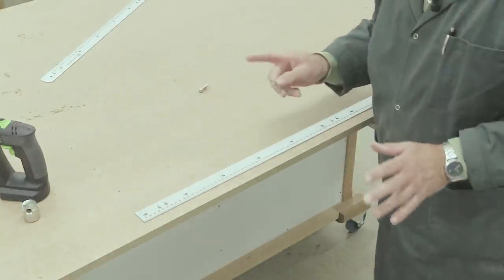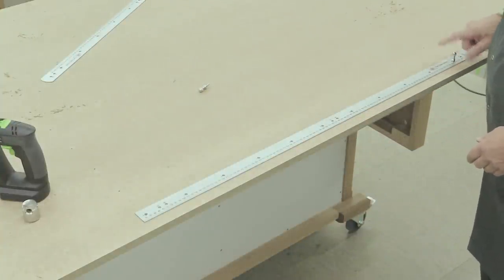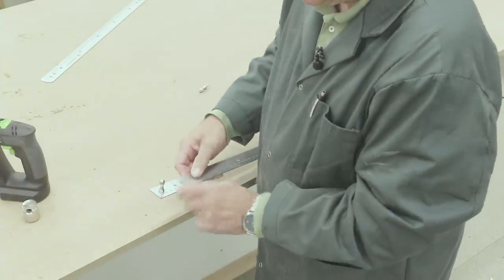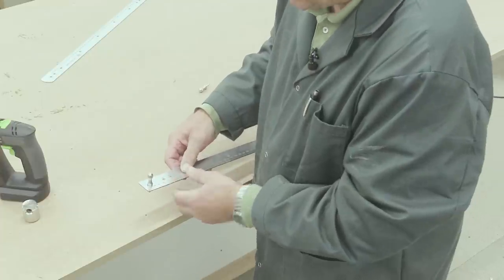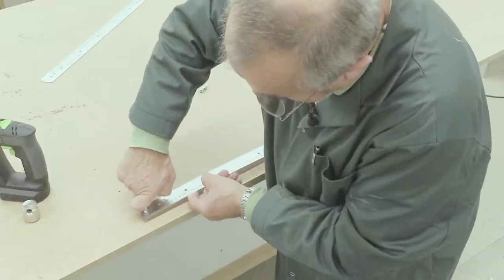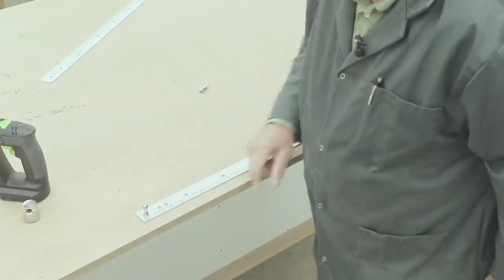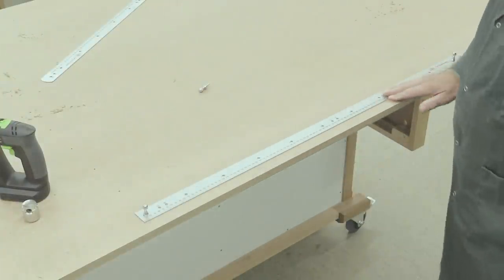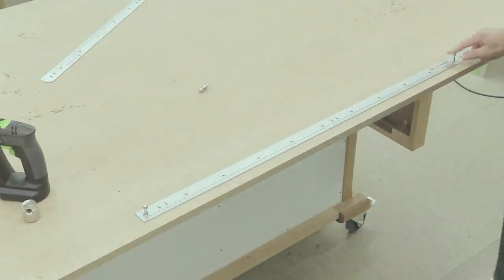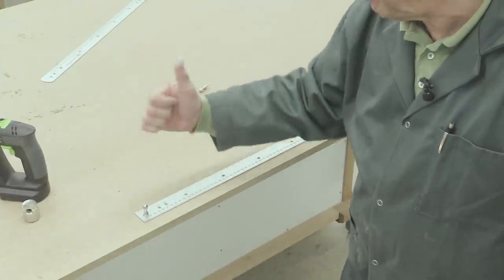And now it's a good idea to do a check. I've put a pin in here through position 10 on this path stick, and that's seated properly. I'm going to seat this pin so it's properly located in that 6mm hole. I'm then going to lower this down and then keep a bit of upward pressure on the ruler and push down, and in it goes. And if that goes in so that the path stick is nice and flat, the pin is engaged there, the pin is engaged there, that means then that those first two columns that we've done are perfect.